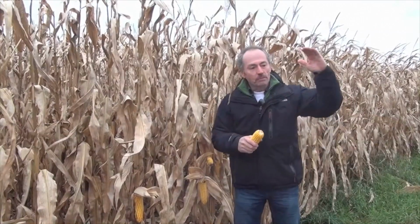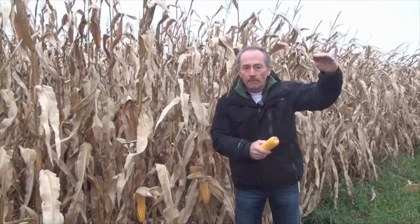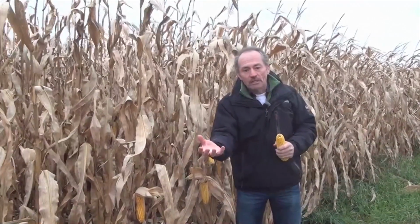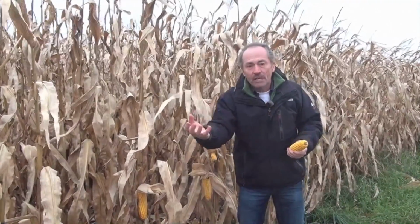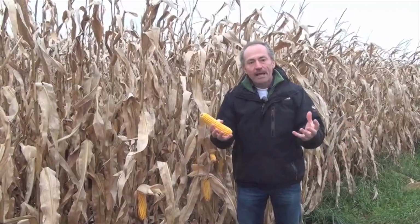So you have your plenum temperature at whatever, 200 degrees. You let it come through and get to equilibrium moisture content, 14.5, whatever you're going to. Do a test weight. Then drop your plenum temperature 10 degrees, so go to 190, and then let it come to equilibrium, do another test weight. So if you were at 51.2 and you drop the plenum temperature, you get to 51.3, that's a gain, so drop it another 10, and just repeat the process until you no longer gain that test weight.